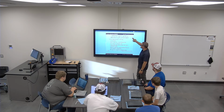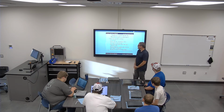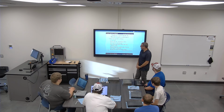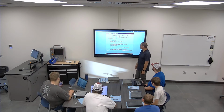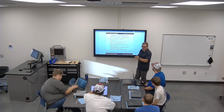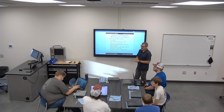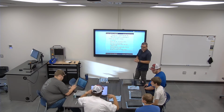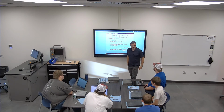What we don't want to do is have some kind of problem. General clothing for a machining environment: we'll have our machining work shirts soon. And then everything else is really stuff that we've talked about. No gloves except for specific tasks. Make sure that you have anything that is long and dangly out of the way. I love those lanyards, but they should not be around your neck when you're out in the shop. They're just going to be way too dangerous. Honestly, even putting the lanyard in your pocket, letting that lanyard hang out.